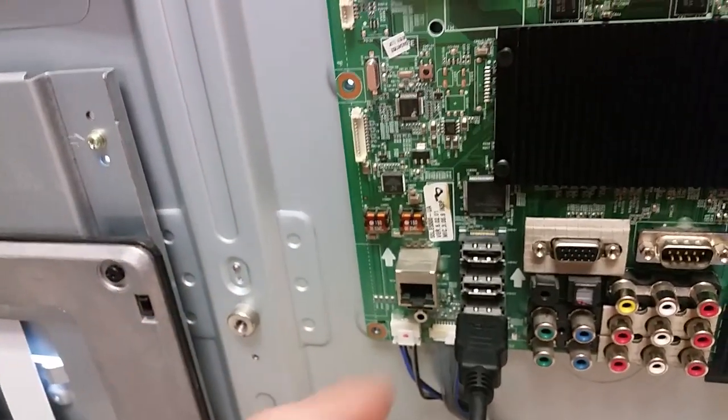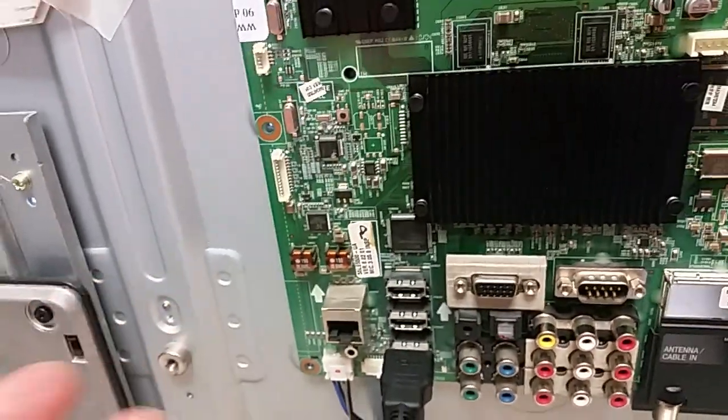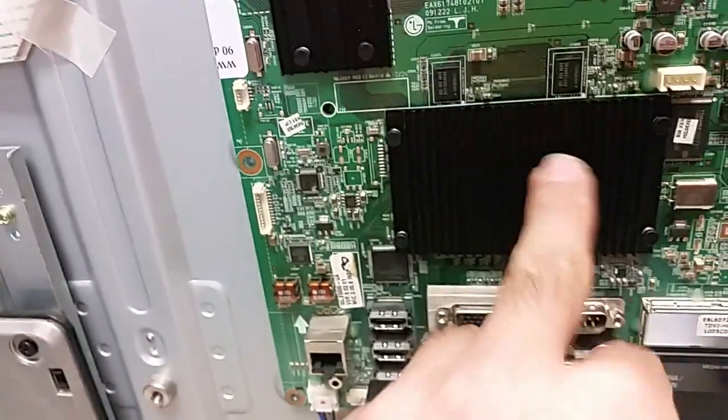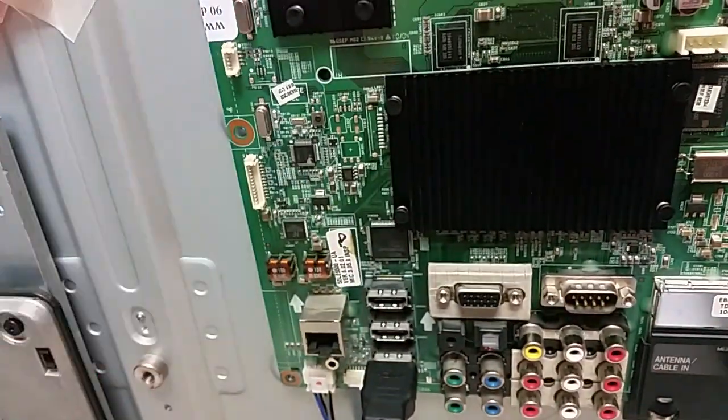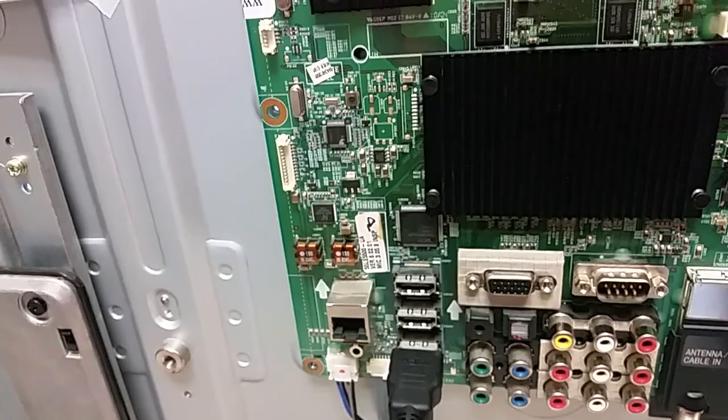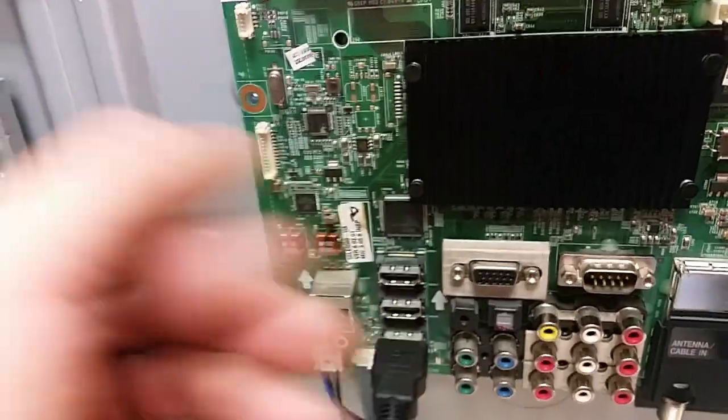We've seen it before, but usually when the whole TV doesn't work or misbehaves, or when all ports don't work, the problem is in the main processor. When a single port doesn't work, and that's usually the sole complaint about the board, it's usually the HDMI selector.